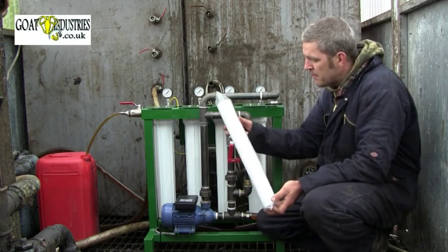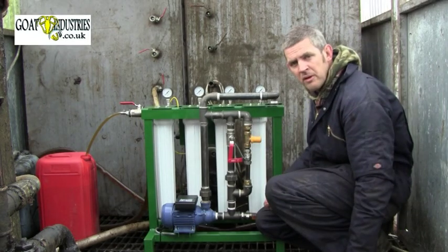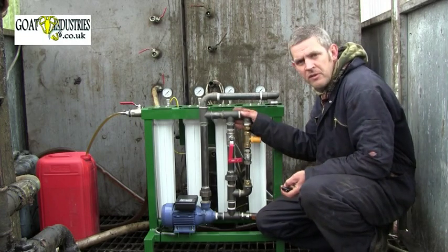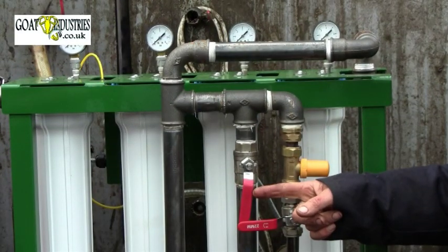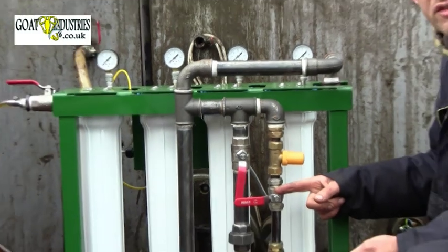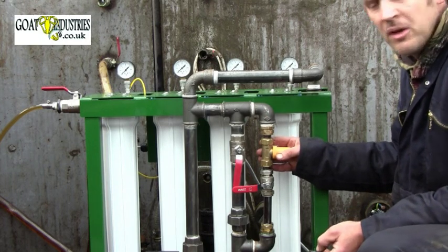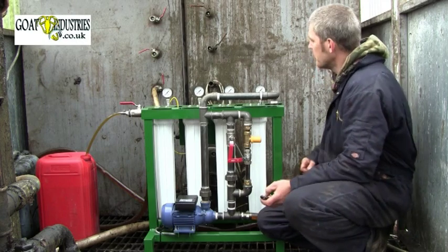The cartridges in this system at the moment are melt blown and they're rated to 0.8 bar. So it's very important when filtering the vegetable oil to keep the differential pressure down to 0.8 bar, and that's done using this diversion valve assembly here. We've got first a coarse valve here and that will set the initial pressure to 0.8 bar. Then during the process of filtration, this automatic valve here will keep the pressure to 0.8 bar as the cartridges start to get blocked up.